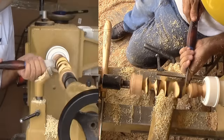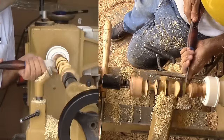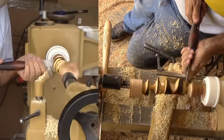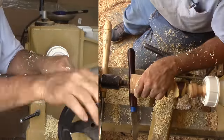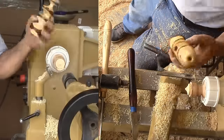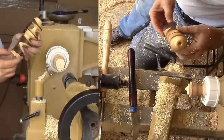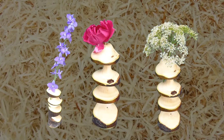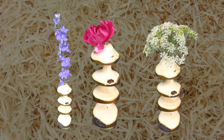And the twig vase is finished. The scrap end block with a tenon to go into the vase neck worked to keep tail stock pressure. The principle is simple: find a way to keep pressure and allow axis repositioning without consuming good turning wood. As for the vase, who's to say what an eccentric natural edge vase should look like. It's deliberately weird and draws attention to its weirdness.